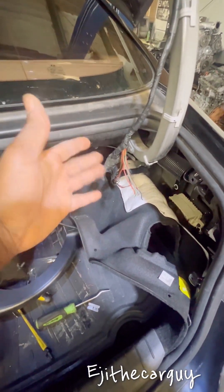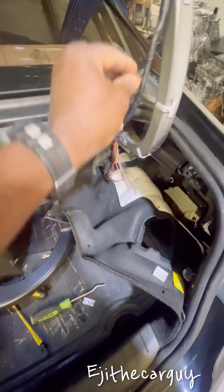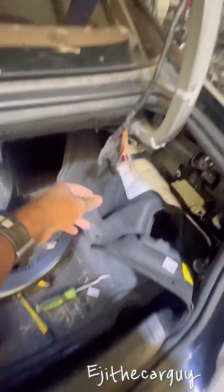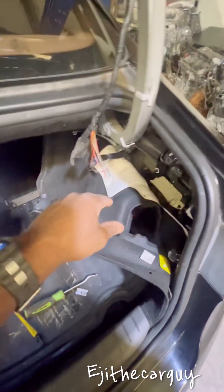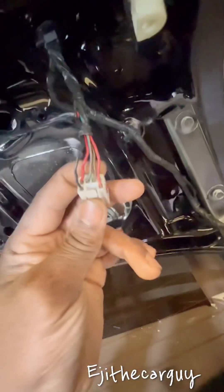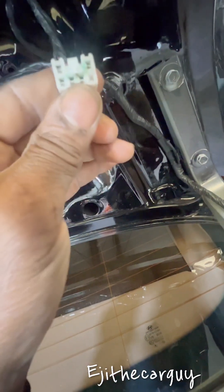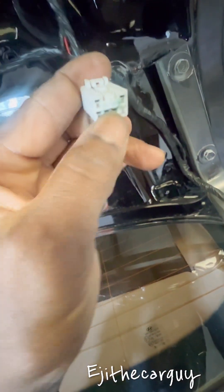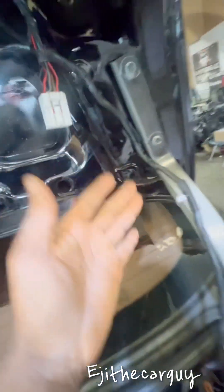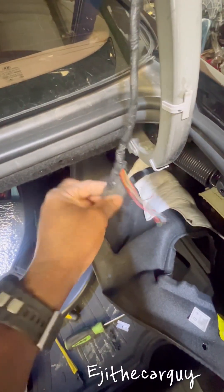I started tracing the wire — first, of course, checked all the fuses, fuse was good. I started wiggling it over here and something kind of came on while the lights were on, so I figured there was a loose wire. You can see where I pierced some of the wire trying to test from the back, because I thought it was the pin which was corroded in the front, but there was still no power. So I followed it down, opening up all the insulation.